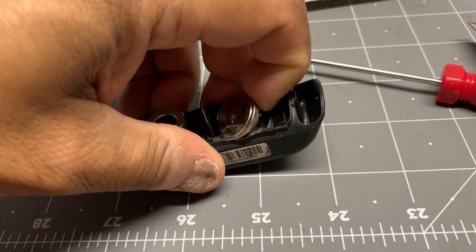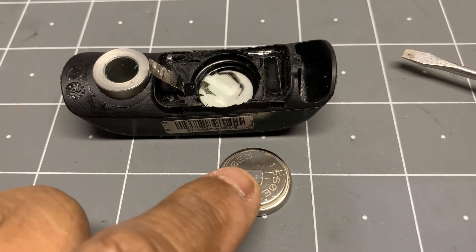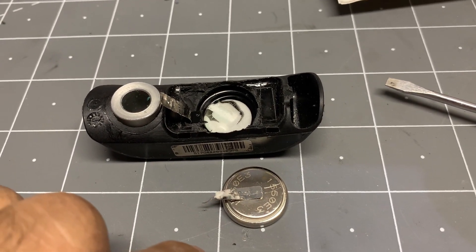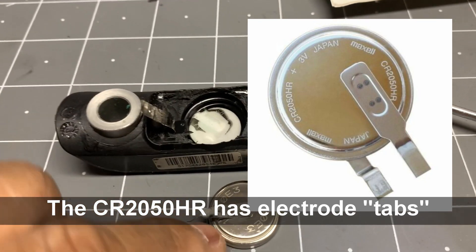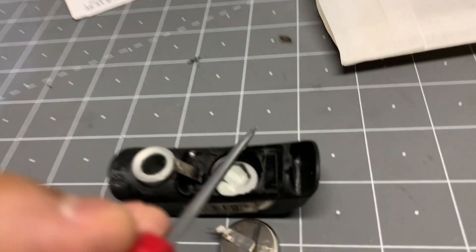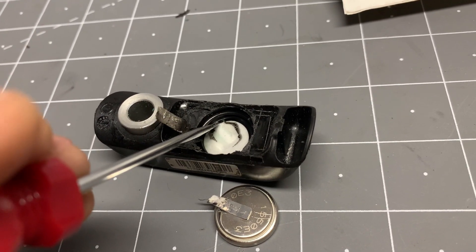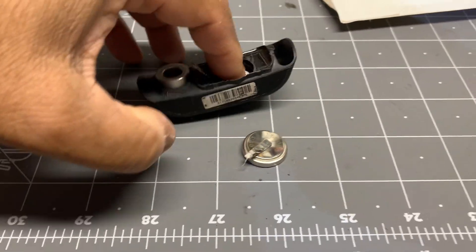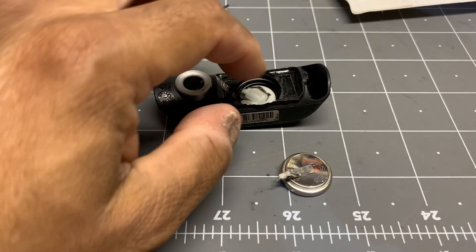I got my little screwdriver underneath and it's kind of stuck down. This here is the other electrode which is welded on to the battery. It's not just resting on the battery as in many types of connections where there's a button cell battery in, say, your watch. It's welded on there, and when you pry this battery out you end up pulling out the connection to the electrode. The electrode — that little skinny piece — comes out from inside there, and the connection goes underneath. This thing was stuck down in there and you need to break that really good sticky bond to pry it out.